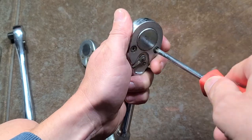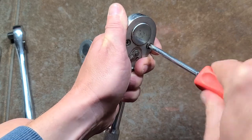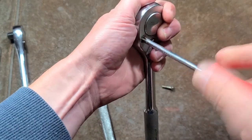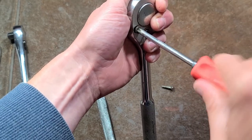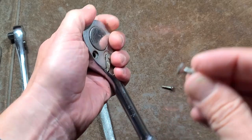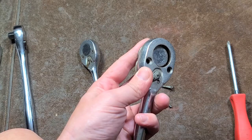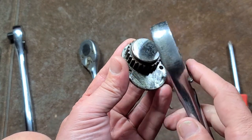Let's just pop this open — a couple of Phillips head screws. The ends of these screws are not happy, but they'll straighten out by removing the screw. I don't think this ratchet's ever been open. I'll probably impact these screws out. That screw I think is bent — yeah, a little bit of a bent screw. See if we can get this plate out of here. Had the hammer on the back of that. Surprised the anvil has so much play when it is a 3D anvil supported on both sides.